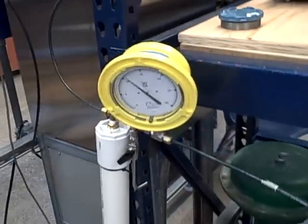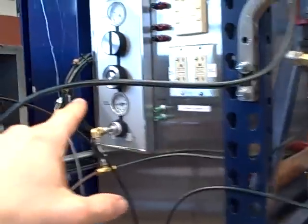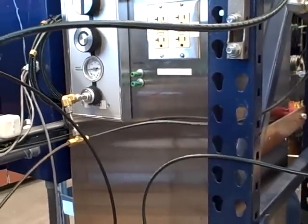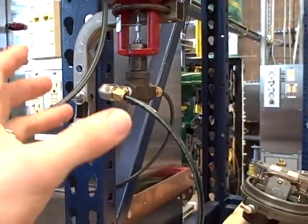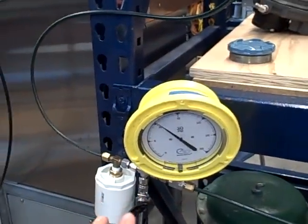However, one of the loads we must contend with in this process is the air supply. The air supply comes from a regulator and is itself variable. If that air pressure varies, it's going to cause more or less air to go into the tank, and that's also a load that the controller has to compensate for.